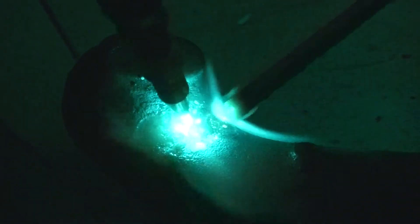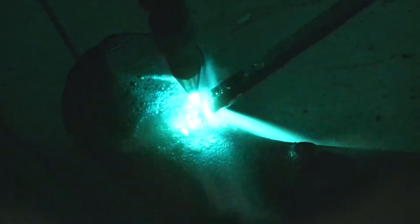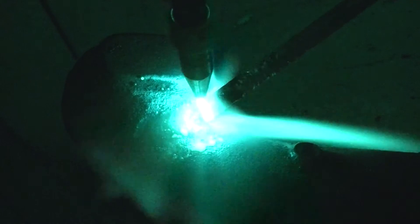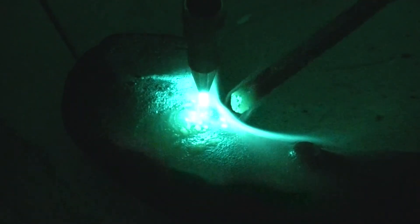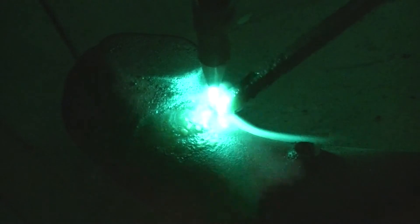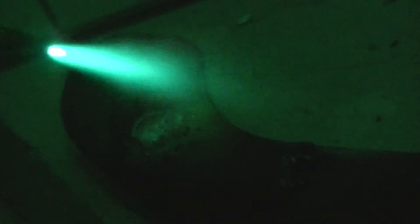Now we can naturally let this rust out. Some guys use a peening hammer — or what I'll call a slag hammer that arc welders use — it's got a bunch of needles in it and it actually makes the surface look rough. Or you can take some heavy 40-grit sandpaper upside down and pound it against it — makes it a nice clean finish. Now I'm going to just post-heat just a little bit, just to slow down the cooling and give us a real nice soft weld.